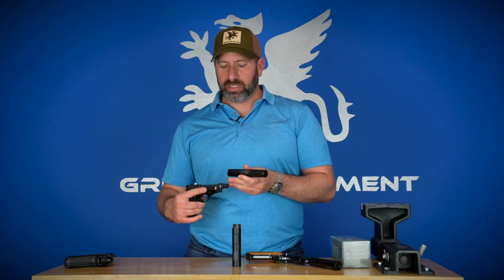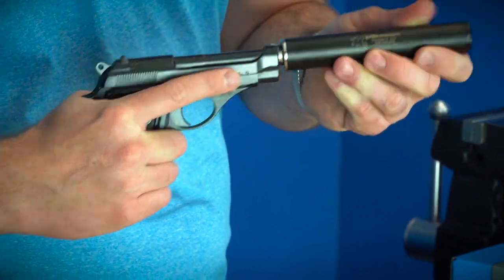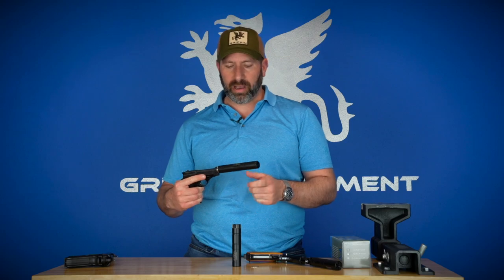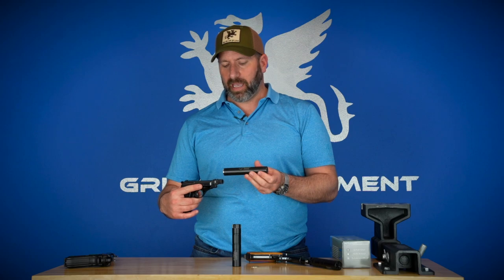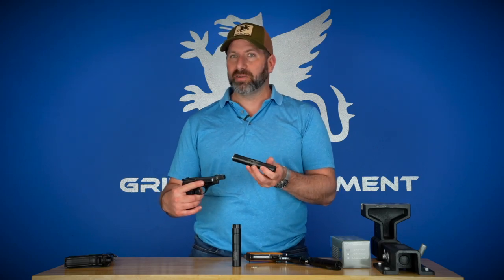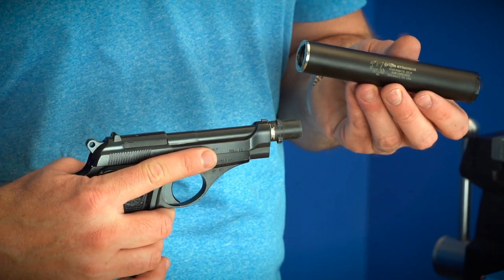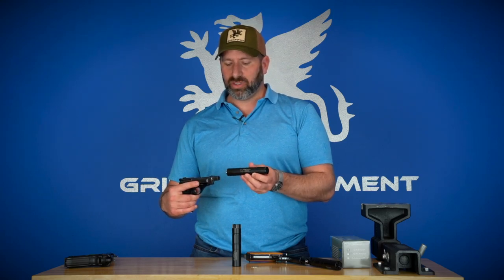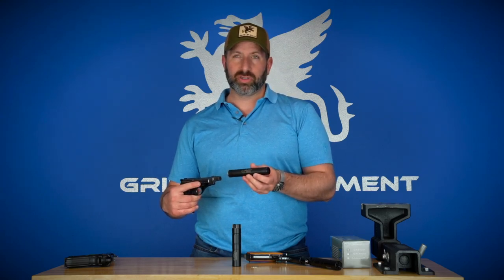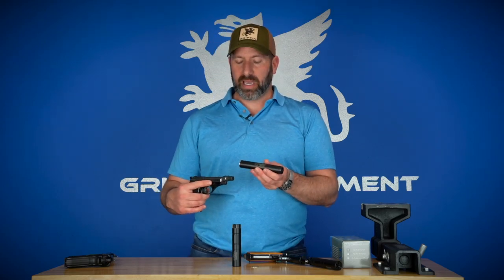This product was really cool because it had a miniaturized three-lug spring mounting system, kind of like a mini MP5 three-lug, so it would snap on and snap off. A lot of people really liked this, but there were some drawbacks. If the unit got carboned up, it needed to be cleaned quite often. When it did get carboned up, sometimes it would have a little bit of issue with being totally straight and having low POI shift. So there is a reason why we kind of went away from making that three-lug system.